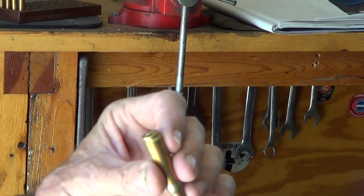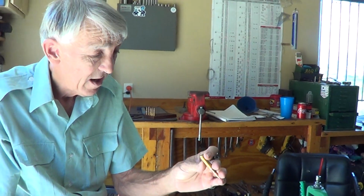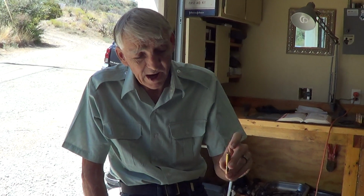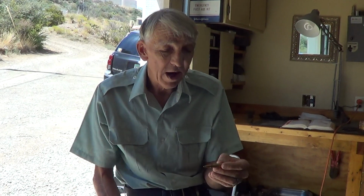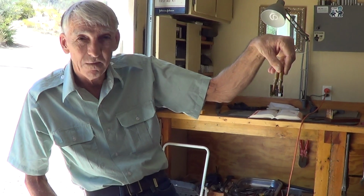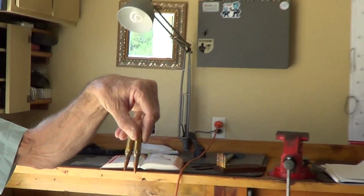I don't know why they would let anything like this go through the factory. It's evident that their equipment is out of time and out of sequence for the primers to be smeared in like this. They appear to be somewhat crimped in, and they've got a red primer sealant around them. Why they did not use the same sealant around the bullet instead of using coal tar for it, I don't know. Also, we had some dented cases that looked like they had been run over by a half track, 2 of those out of the 500.